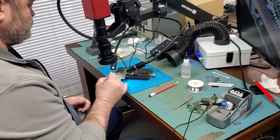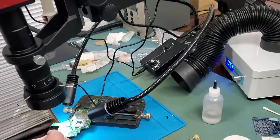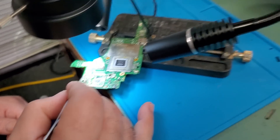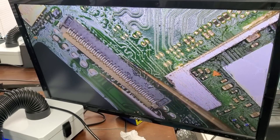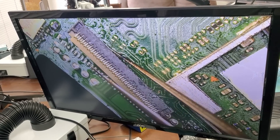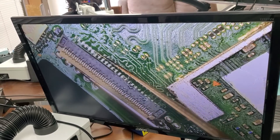That's what the students are doing right now. We're going to check on Add — did you already remove the connector? Yes, and put the new one in. Align that connector as much as possible and do not touch it after you align it. Heat up from the bottom.